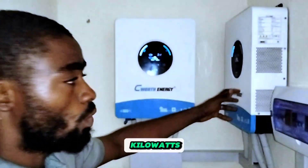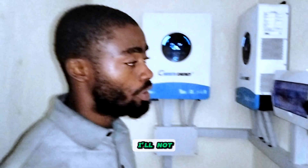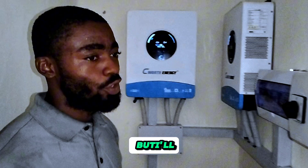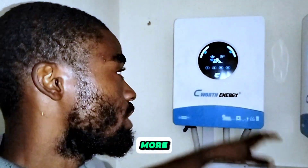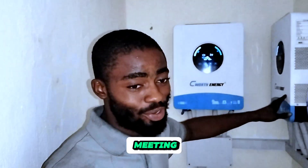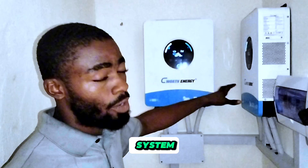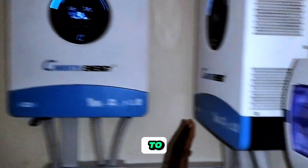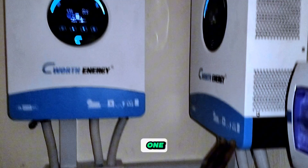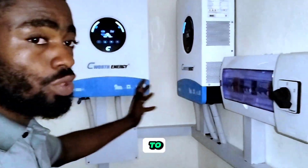This 6 plus this 6 gives us 12 kilowatts and they can handle more electronics. I will say the details about the paralleling should be made more simple, because it took me about 40 minutes to figure this out. I sat down, I didn't see enough on the manual — I had to use my brain before figuring it out. Now the output of this one is connected to the output of the other, and both are working together as one, sending power to the house.